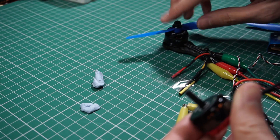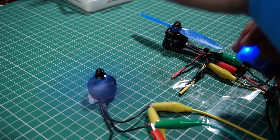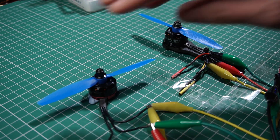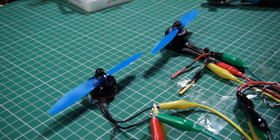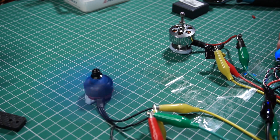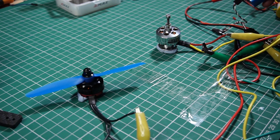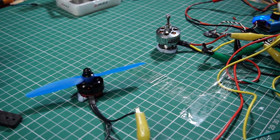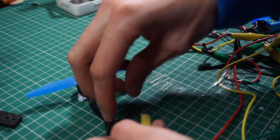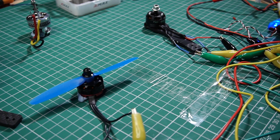Now I'm going to use another motor similar to the one I'm using but a different brand. Both motors are 2205 in size and have the same number of poles and magnets, but they perform a little differently. And there you have it — both motors are connected but only one works. Even changing the wiring, only one motor will work. There is a lot more going on in the background, like physics and mathematics, but the result is that two motors with different characteristics won't work on a single ESC.